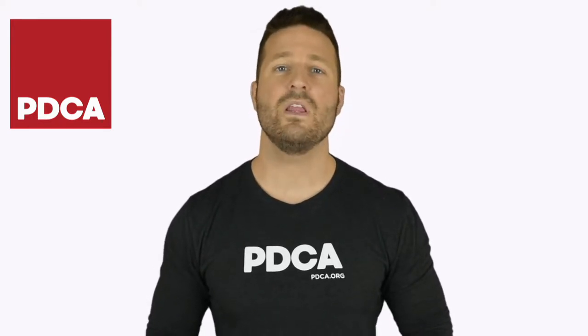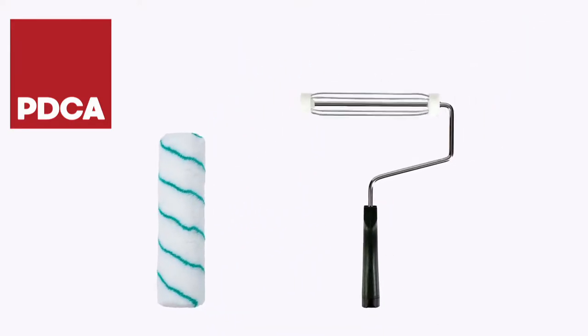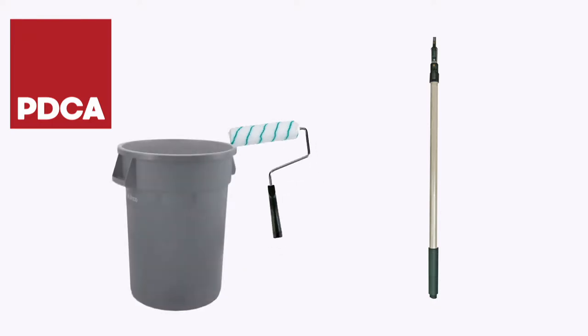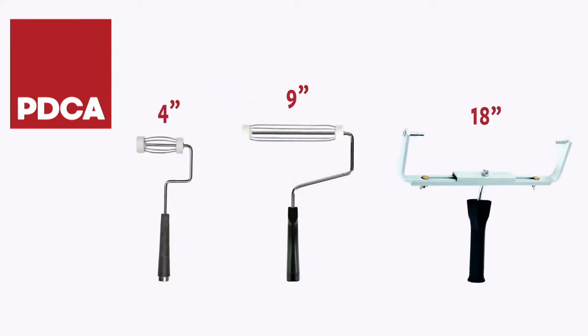Let's go over the three key parts of a roller system. There's a roller cover, the roller frame, and usually an extension pole. The roller frame holds the roller cover. The frame should hold the cover securely so it doesn't slip, but allow quick one-wrap removal. Roller frames range from 4 inches to the very common 9 inches and up to big time, 18 inches.